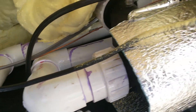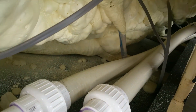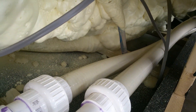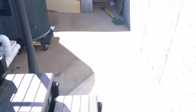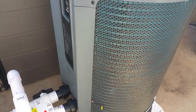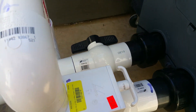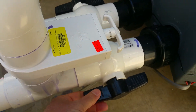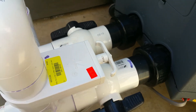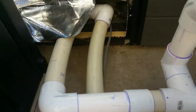I got some two-inch pipe and took that piece of pipe down to the side — I'll show you here. I hooked it up through some flexible PVC hose, also from Spa Depot, and took it to my 65,000 BTU heat pump. I use ball valves because gate valves can leak sometimes if I ever wanted to disconnect and shut off. These will always be leaking, so I put ball valves in here, with a bypass using this gate valve and my flexible hoses.